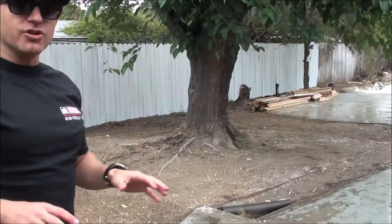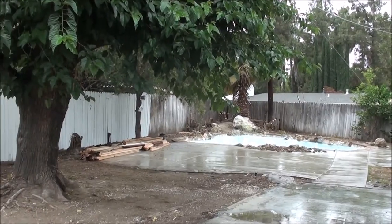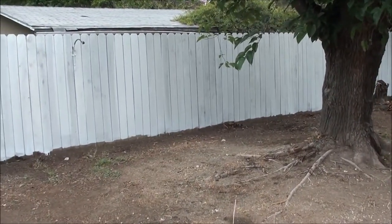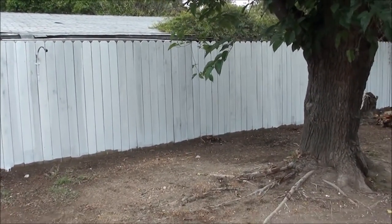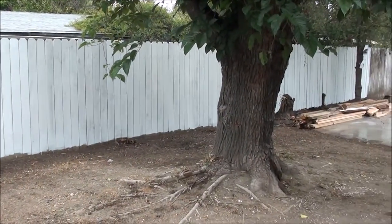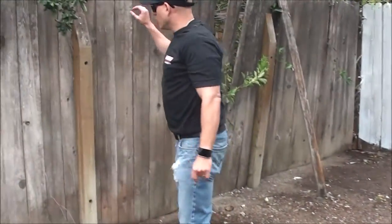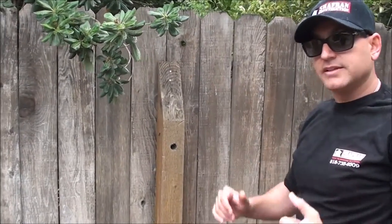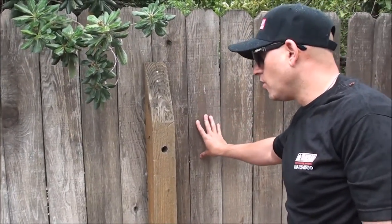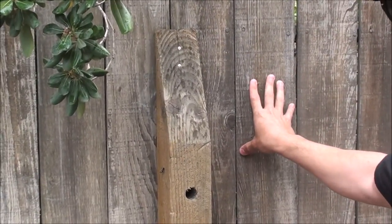This backyard was covered with vegetation all the way up in previous pictures and videos. The back fence was shifted and we peeled it back, and now we put one primer coat on just a portion of the section. When you deal with weathered or any type of brown wood, before you paint it you have to sand it down, prep it correctly, fill in the gaps and grooves and holes, and then apply a very thick primer. We like to use a Zinsser Cover Stain product.